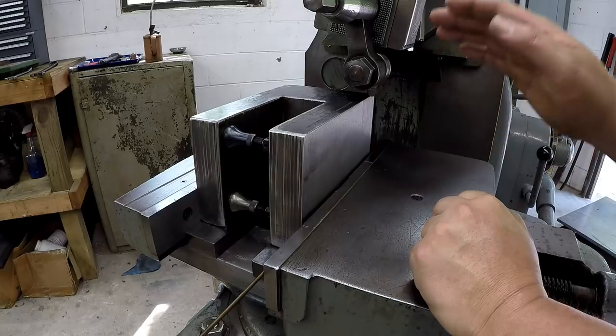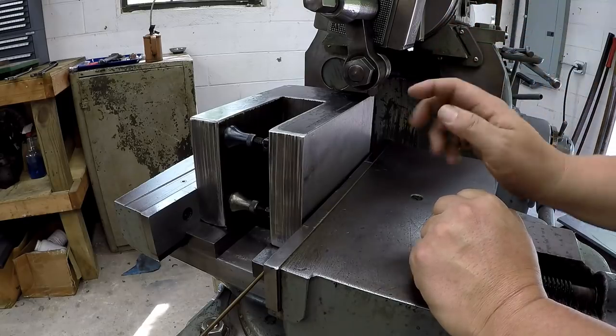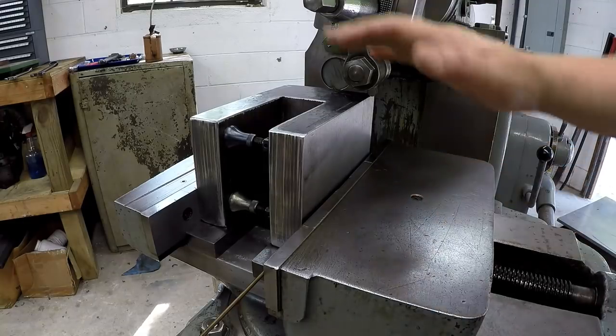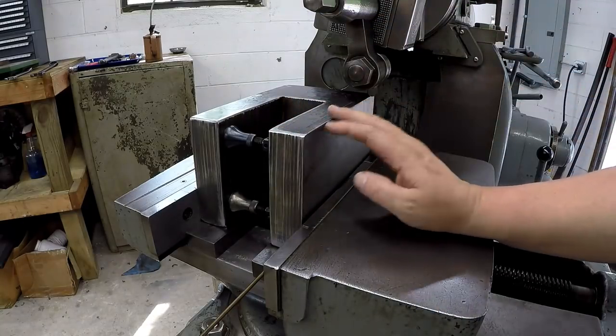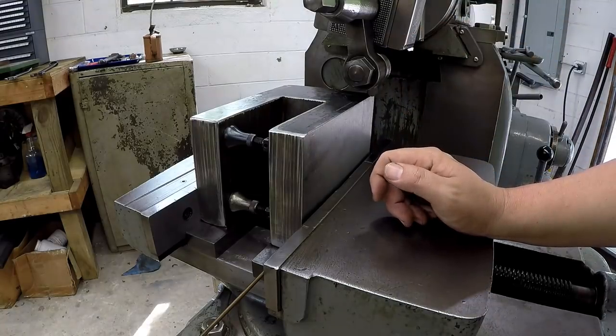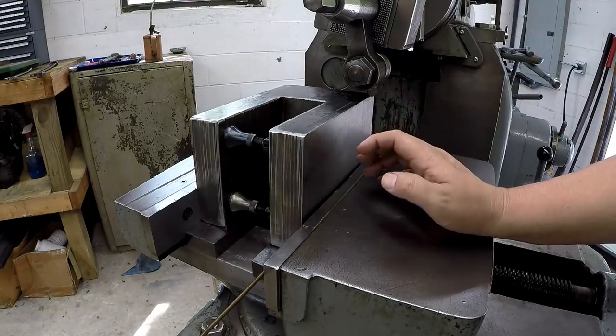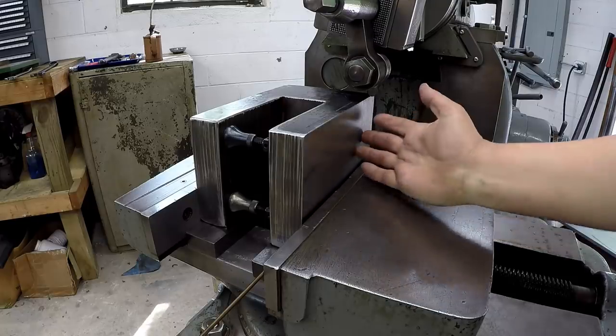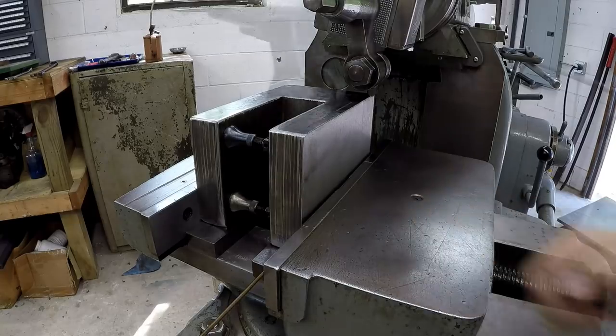So we've got it touched off. I moved it down 20 thousandths. We're gonna clean this side up, and I'm gonna continue flipping this until I get it square. This is exactly why I wanted to do this, because this is a very good practice exercise for the shaper, making a square block and getting something square to size, and practicing our finishing too.